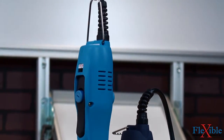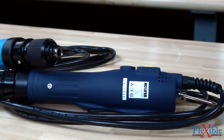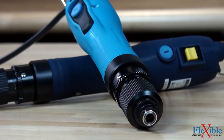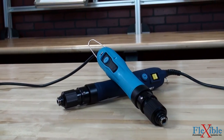The ACC electric screwdrivers are designed to tighten to preset torque values for any fasteners up to M5 using their quarter inch hex drives. Five different inline models are available with torque ranges from 1.7 to 39.8 inch-pounds and free speeds from 450 to 2400 RPM.